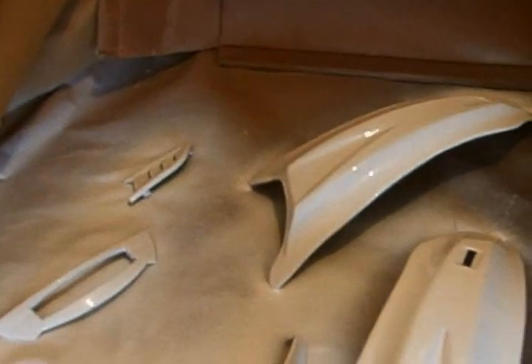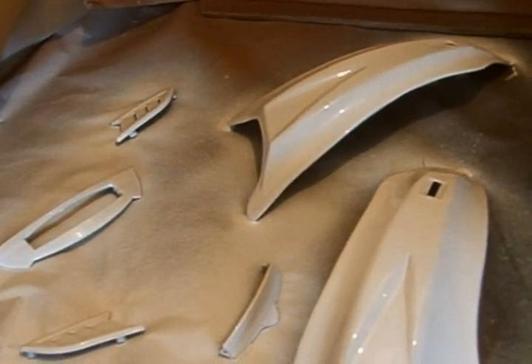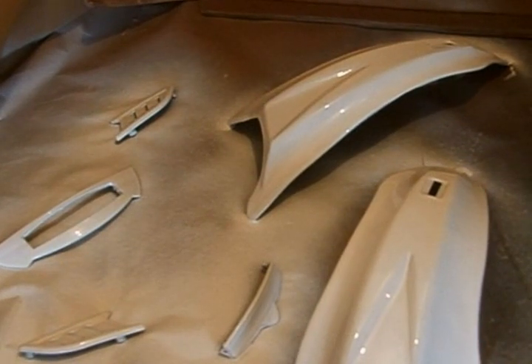The primer is now dry. I'm going to use some P1200 very smooth paper to flatten the primer. This will remove all the high parts from where the sticker was, all the dents and scratches, and level it all off without removing the paint I've just put on. White primer on all the plastic trim bits — these are now going to get fluorescent green paint and then glow-in-the-dark paint. The lid has its first single coat of satin black.